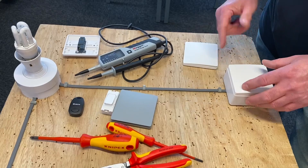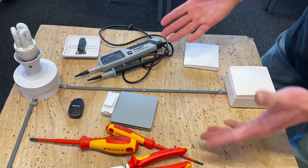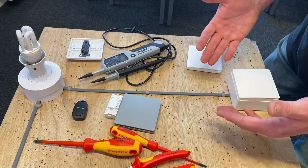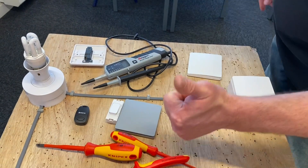Simple process: take off a one-gang one-way switch, install your inline receiver which works with kinetic energy from the switch to the receiver — it's a Quinetic brand — to make two-way switching. Hopefully that's answered the two questions I predominantly got from the first video: what happens when the power goes off — they stay paired — and how do you unpair them. We cleared and unpaired it, and we re-paired one as well.